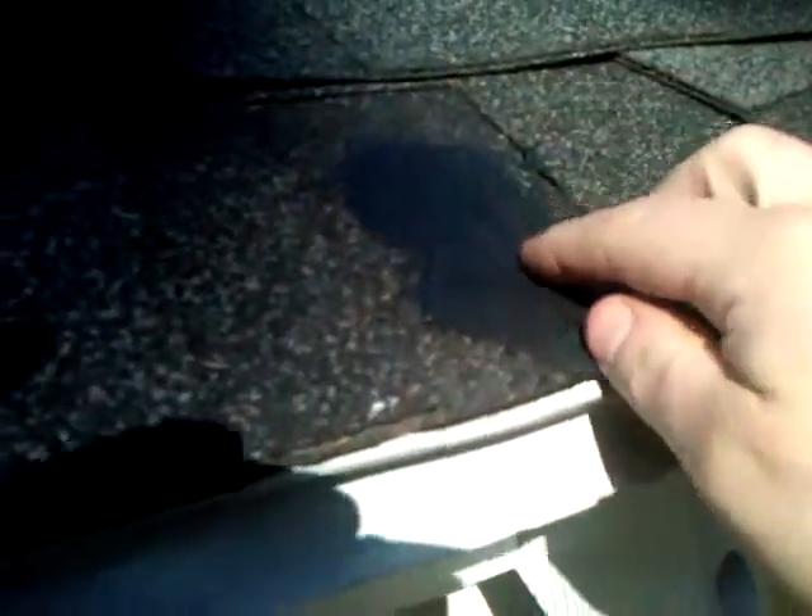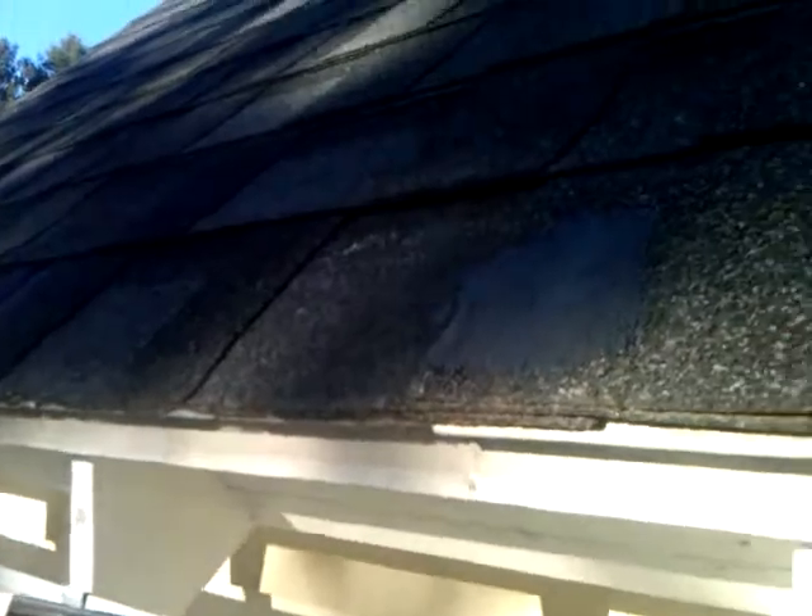In the valley I need to put a little diverter that sticks up at about a 90-degree angle because water is going to overshoot the roof. If I put it out too far, the drip edge won't catch inside — you can see the drip edge there. I also used fabric and a neoprene rubber elastomer to seal all the holes left by the old strap hangers, using sealant plus fiberglass fabric.